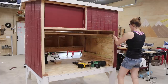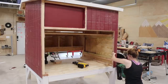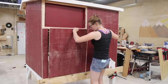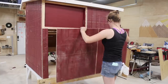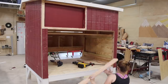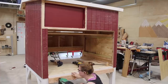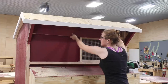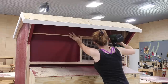I designed a big removable panel in the back wall so I can easily access the inside of the coop and clean it out. I attached siding all around this panel and then started working on the panel itself, though I can't complete it until the trim step. After getting the parts cut, I set them aside and continued siding the other sides of the coop. If you're using tongue and groove sheets, pay attention to how you're cutting your parts so that when you line two up, they overlap correctly.